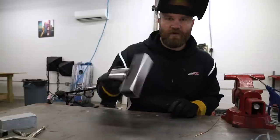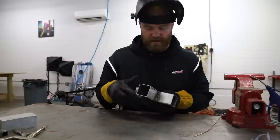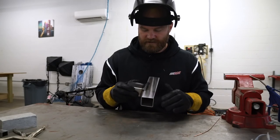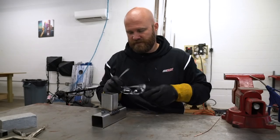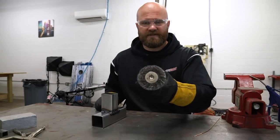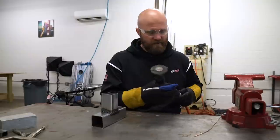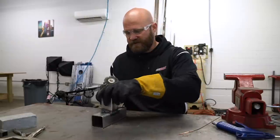Now that we have the whole thing tacked up, the only thing left is to clean up all this color and get it back to a clean slate — kind of like where we were starting, without all this oxidation. For that I'm going to start with a wire wheel because it's still kind of warm and it won't bother this wheel like it would the Scotch-Brite; it'd probably burn up the Scotch-Brite.